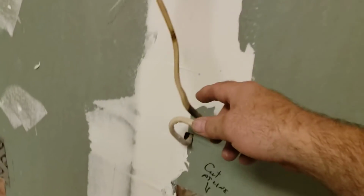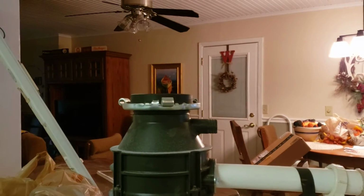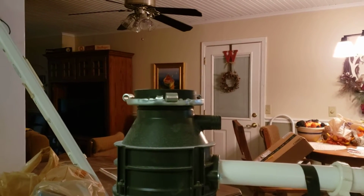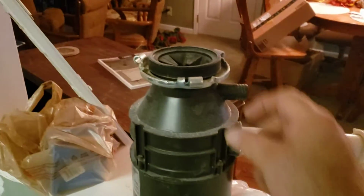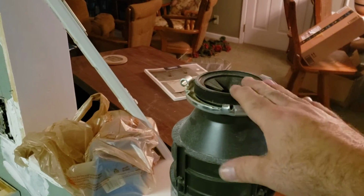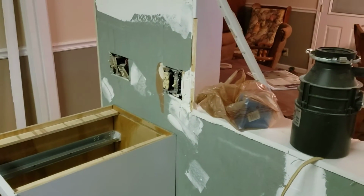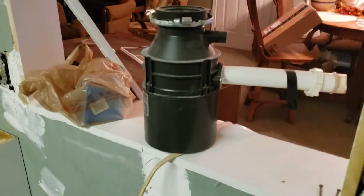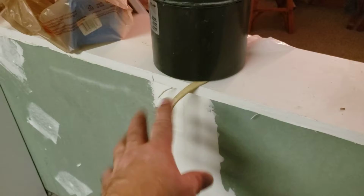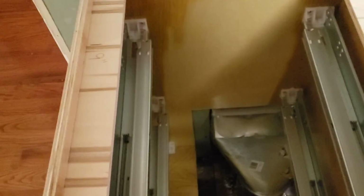This right here, the disposer: when they removed the sink, they left the strainer basket assembly in the old sink. So this is going to need a disposer basket assembly, which is the clamping mechanism and the strainer insides, to replace this with. So if you want to take this video to the store, Beth can help you get that part, okay? And then this piece here, the electrical to the disposer, needs to be taken apart so that we can put that inside the cabinet.